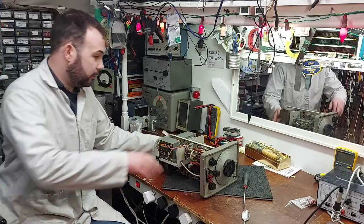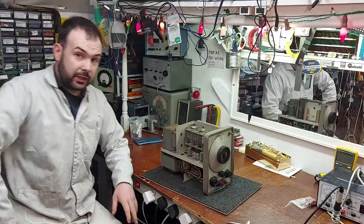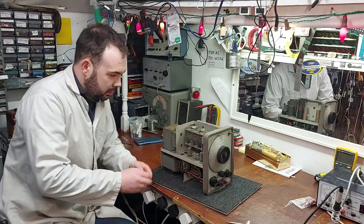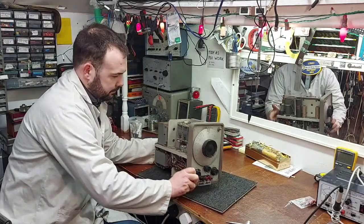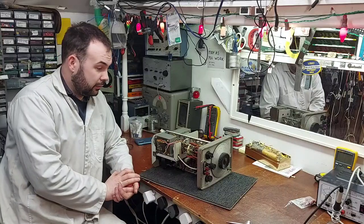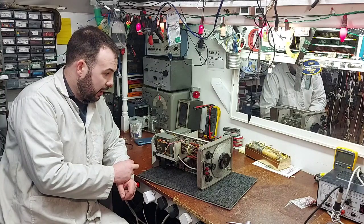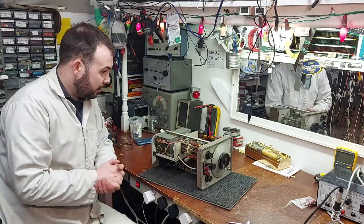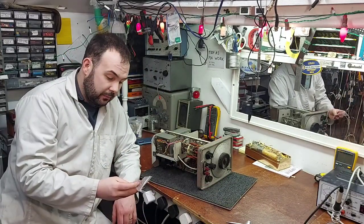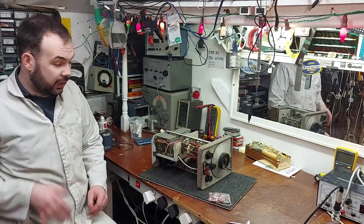This is the HP202 with a low frequency generator, which I'm getting back to. The only thing I want to do to this, and then I'm going to box it up, is clean it all up — it's absolutely filthy. There are two 1uF coupling caps underneath on the board. Reading around on the various forums, I'm told that these go leaky and will stop it from oscillating. So I'm going to replace those. Many months ago I ordered some 1uF caps from China, and they have duly arrived, so I'm going to stick them in. It's a little bit awkward to get at — I'll bring the camera in and show you what I'm doing.